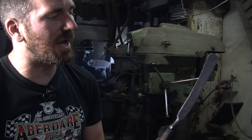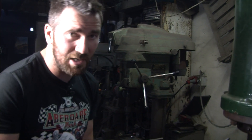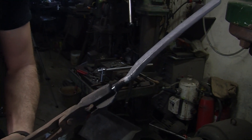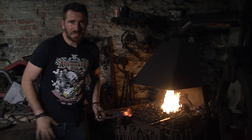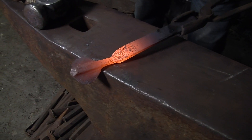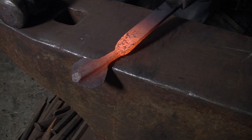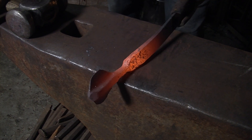There we've got the handle flattened out. I've finished this bit on the anvil — it's a bit easier than doing it under the power hammer, but we're going to need another heat for that. Now we want to stretch this out, thin it slightly, turn it into a bit of a square. Turn the round piece into a square to match the piece on the back of the fixing plate, and basically turn it into a handle.